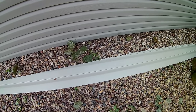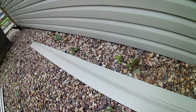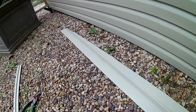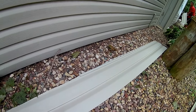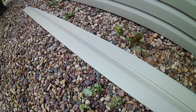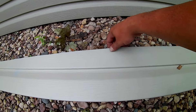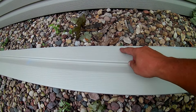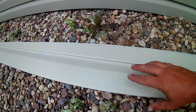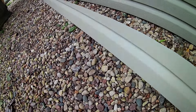Here's our piece — this is kind of a weird piece, you're not going to see this on every house, but this is how we do all of our top pieces. I rarely use under sill; in some scenarios I will, but when I get called out for siding repairs, if a piece is blown off, it's almost always this top piece. What people do is use under sill and a little siding notching tool that puts a little notch in and snaps into that under sill — we do not do that ever, and our pieces do not fall off.